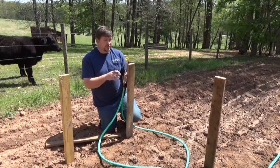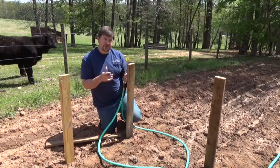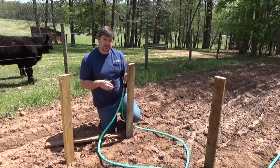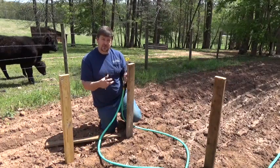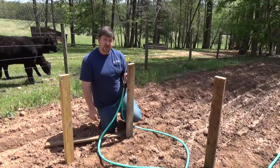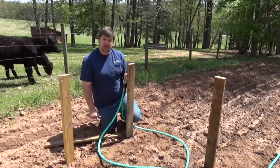I just like putting a concrete base to all the buildings. I don't care if it's a root cellar or a building — you want something to anchor to. I like to use red heads and other concrete anchors so there's no uplift. If there is wind uplift, you're anchored to a lot of concrete. Just building on posts and framing up that way lends itself to a weak structure.